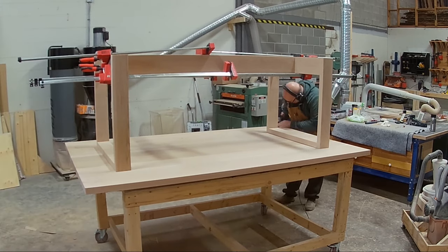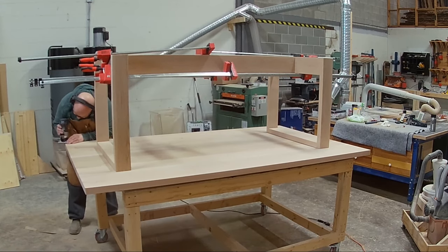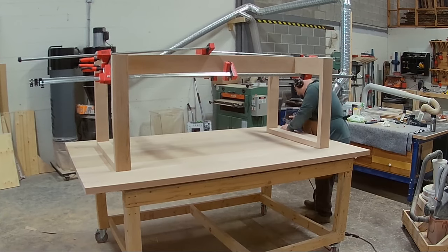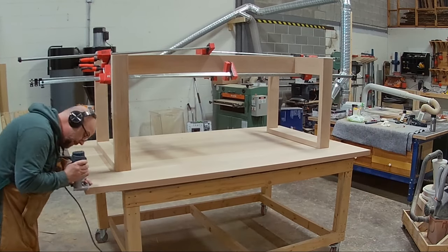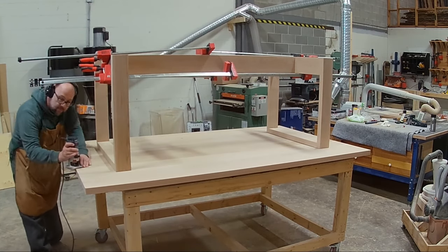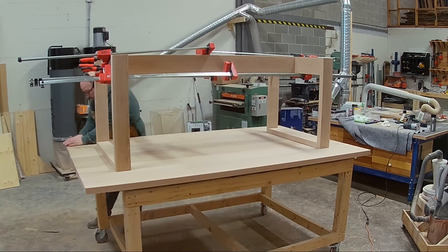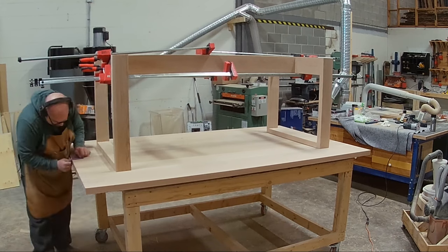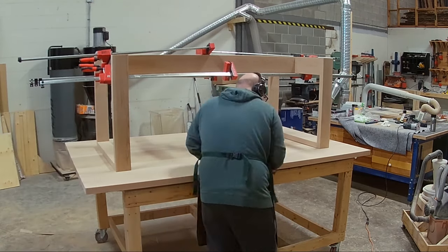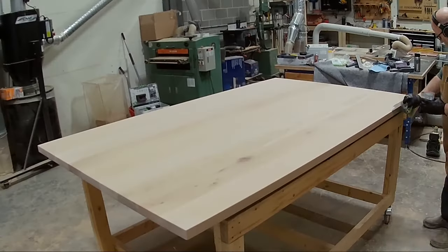I run the router on the edges — on the corners I use a quarter-inch round-over, and along the top and bottom edge I use a one-eighth round-over. It's a nice crisp edge and with this modern style table it looks really slick. The router sometimes leaves a bit of a mark from the bearing riding along the edge, but I just use some sandpaper to smooth it out and make sure it's nice and smooth to the touch.